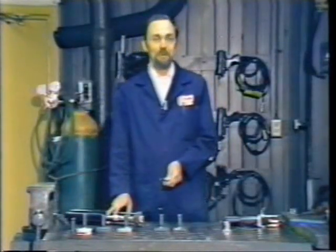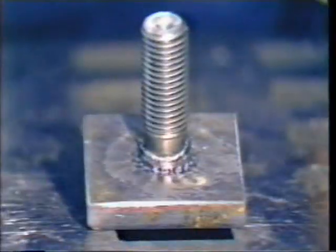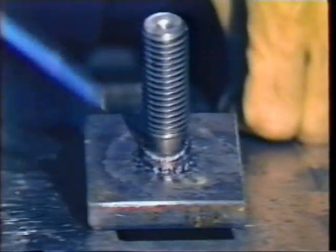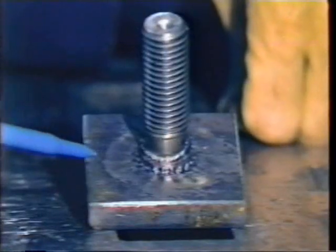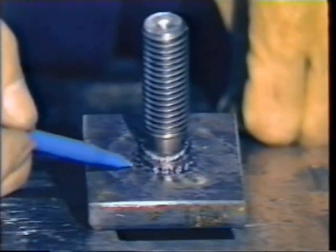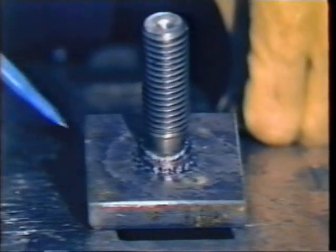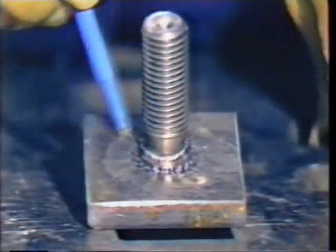Other cases may possibly have ground or fixture problems that can be identified by looking at a weld fillet. A good stud weld onto clean base material is typified by a bright, shiny weld fillet with even height from one side to the other, all the way around. The best indicator, though, is a bright junction of the fillet material into the base material. If that junction is a blend — a shiny radius — rather than material that is rolled under, you're assured that you have bonded metal to the extreme edges of the weld fillet.